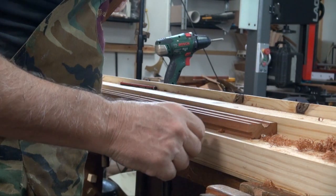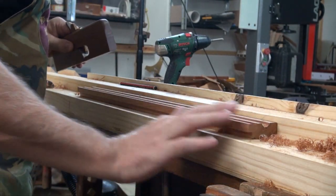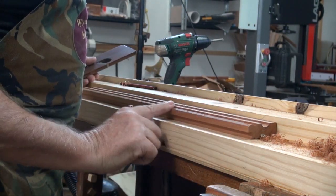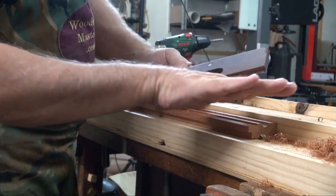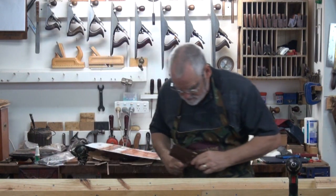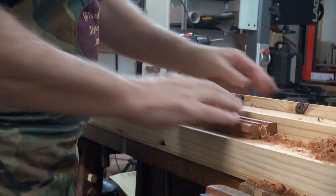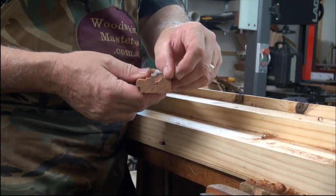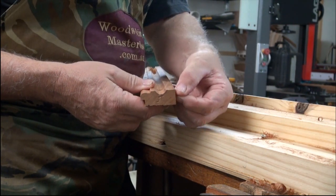And having said that, that's what I'm going to do. I think I'll leave this with a bit of a ramp here and just take a chamfer off this end. Now where I've got two arises, I'll run that bevel down there and run this part of the plane on those two arises — it'll round it over. My profile is starting to take place. What I've just thought of is I'll put a small fillet along here and then round the back over.